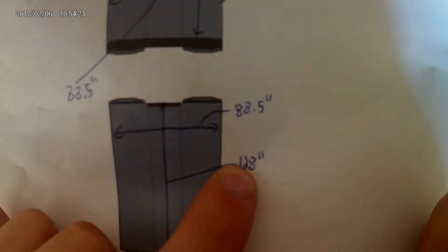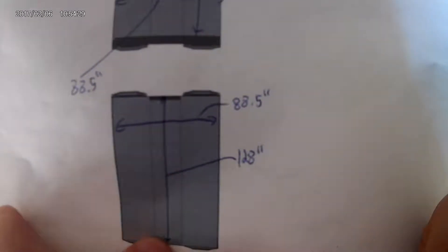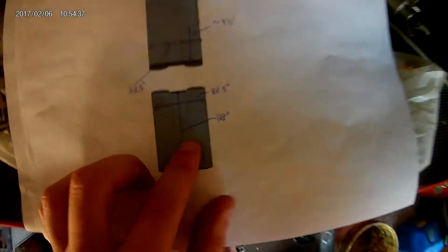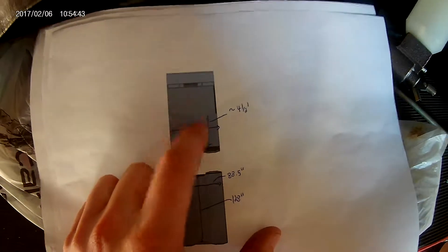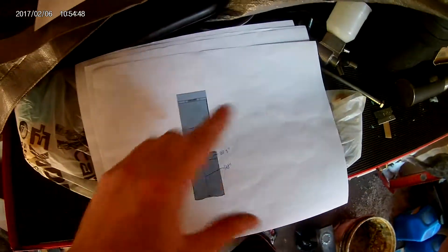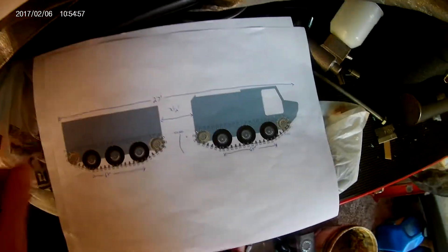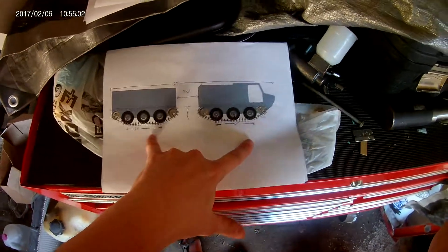Here are the rear car dimensions — kind of like the cargo hold: 88.5 inches wide, 128 inches long. You can almost fit a Toyota Corolla in that, and you can almost carry it too, because of the weight. You can carry three and a half tons in the back and a half ton in the front. From a load distribution standpoint, you're also getting 15 inches of freeboard, so it can take some choppy surf. It's not going to be a small machine — even though it's still considered a mini Vityaz, because a real Vityaz is actually 50 feet long.